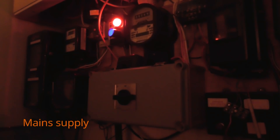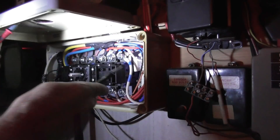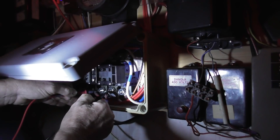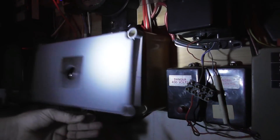All right, stand-by light is on. We're going to do a quick transfer and voltage checks - perfect, smooth, everything appears to be happy. So the house is off-grid. Voltage checks: phase one 233V, phase two 233V, phase three 228V - that's good.